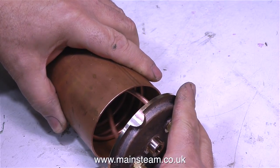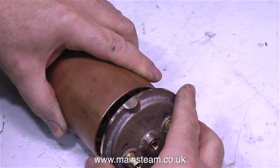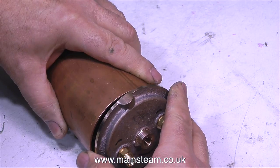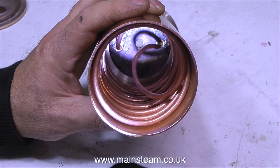Once I've finished the threading, I screwed in a pair of commercial steam unions. But I drilled the centres of these out to 3/16 of an inch diameter, and in this clip I'm just checking that the two pieces of pipe sticking out from the end of the main tube fit into these unions. With the help of my small torch, you can see the internal arrangement.